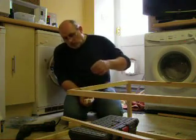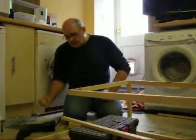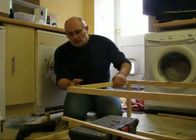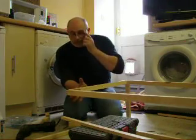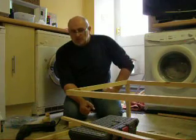I've chickened out and gone for quite a big section — it's 25mm by 35mm, which is amply strong. And even though this looks very flexible at the moment, once you've got the sides — plywood sides sandwiched, or contiboard, whatever it is — it's going to be immensely strong.